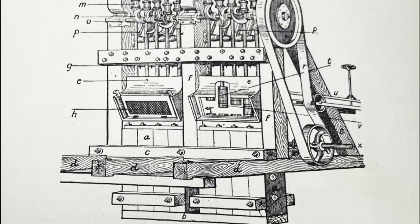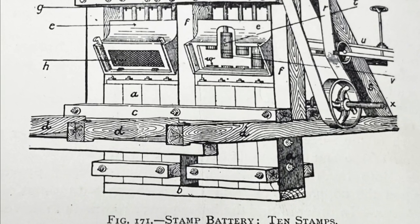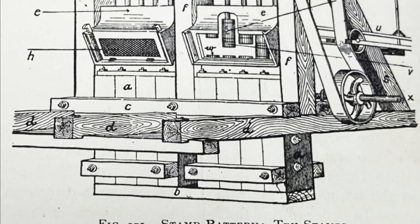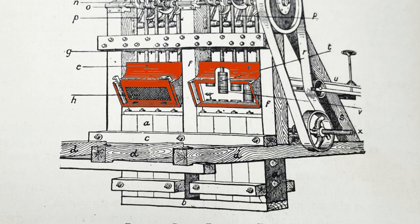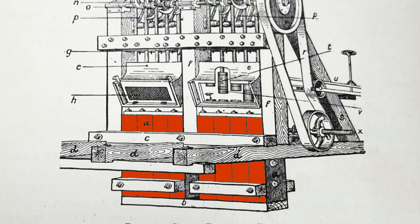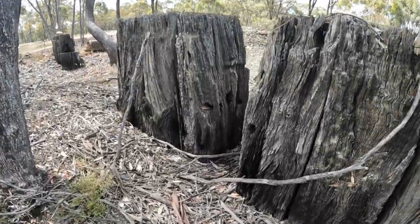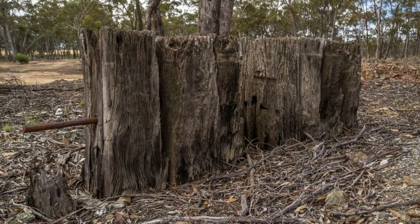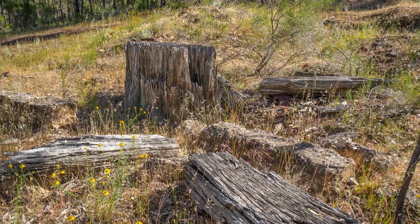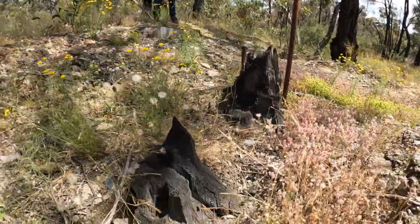This diagram shows the makeup of wooden battery framework. In this video we're going to focus on the lower part of the wooden framework and foundations, which is typically all that survives of battery sites throughout this region, if anything at all. The wooden mortar blocks are shown here, which are long blocks of wood set vertically in the ground upon which the mortar box is set. These wooden blocks help to absorb some of the shock of the machine as it operates. When there is anything remaining of stamp battery foundations out in the bush here, it is usually just the remnants of these wooden mortar blocks. They are sometimes set in concrete like these ones, or sometimes just set directly in the ground. There are not too many sites around which still have these, which is not surprising as they were easily destroyed or deteriorated through fire or general exposure to the weather.